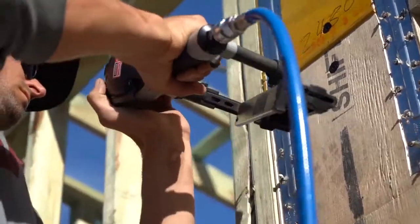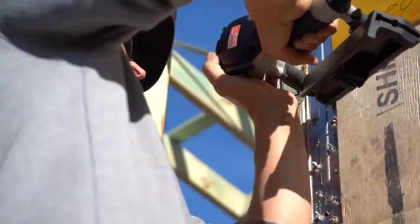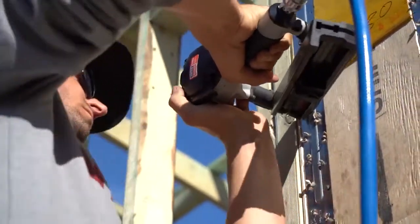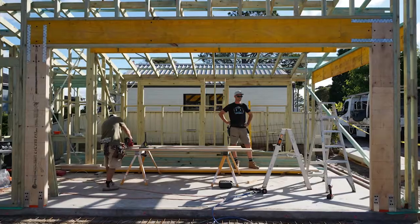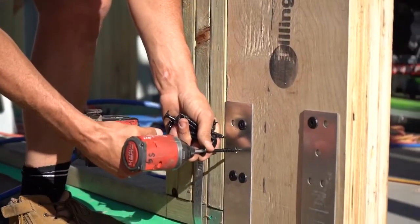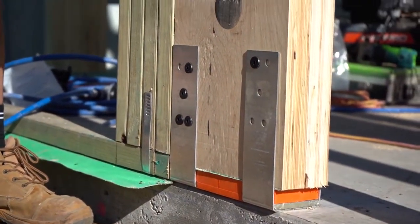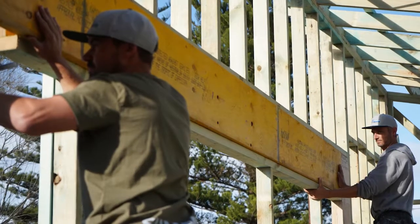A narrow wall width of 240mm or 300mm nominal column sizes means builders can maintain narrow return walls at garage openings, while also allowing designers to maximize portal openings in standard wall frames — making it perfect for large windows and sliding glass doors. Basically, it means more glass, more light, and less wall space.